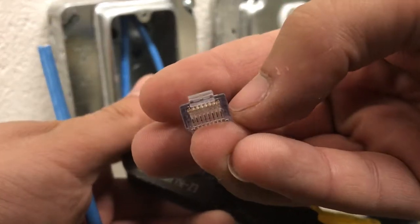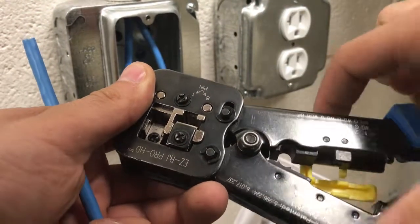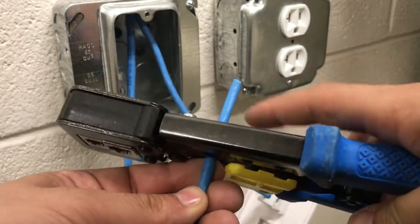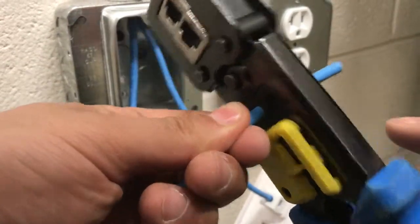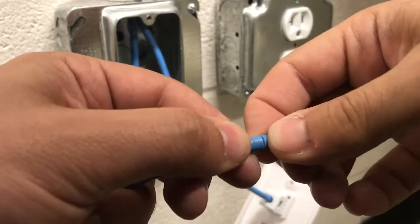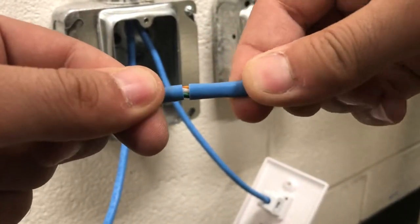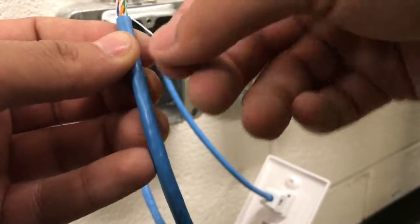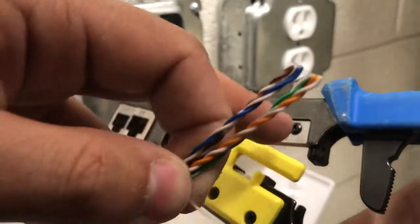The new ethernet heads have a tunnel where the wires go through, so the crimper will cut them off for you — I'll show you what I mean as we go through the video. First, use this part here and I usually go a long way back because I want easy access to the wires — nice long wires to work with. Crimp it down and rotate just once, like this. Don't rotate too many times or it will cut through the lines. Always be easy on it with the wires. Now take off the cap and you'll have a pull string that lets you expose more wire if needed.